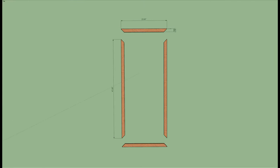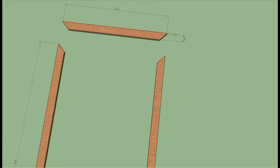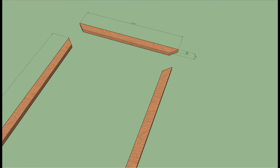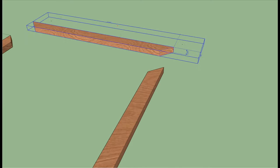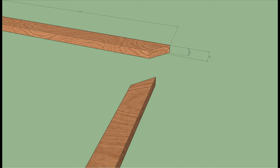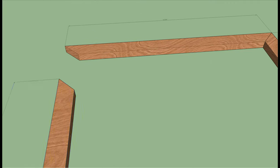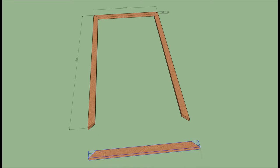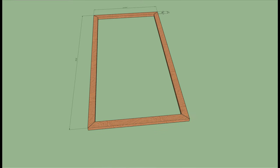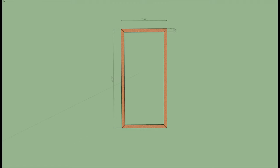On top of the wooden box will be a fabric covered frame. This frame is made out of standard 1x2 furring strips. Again, these are cut on an angle and glued. This time they are stapled on the corners and not nailed. Furring strips tend to warp and bow. That shouldn't be a problem in this application. You can bend them back into shape during the mounting process.